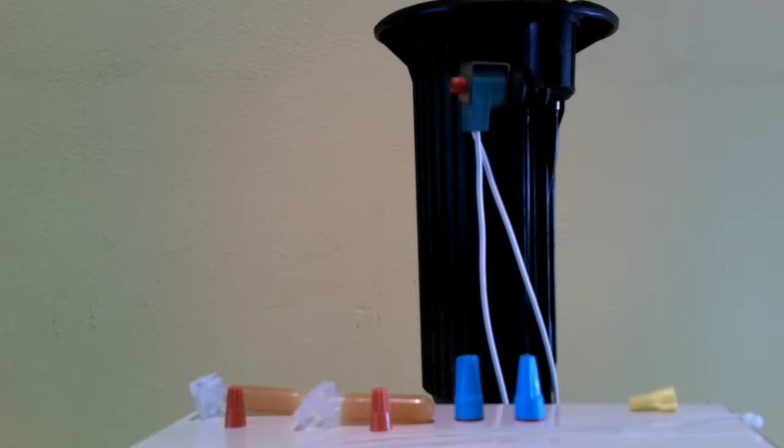Eventually moisture will seep in through the electrical tape, you'll have condensation occurring, it will get in and it will erode the metal components in the wire nut and the wires, and that splice will go bad, and now you'll have to find it, locate it, dig it back up and redo it again. Only if you do it right the first time, you won't have to go back to it.